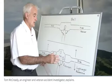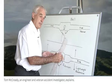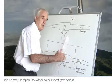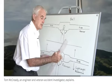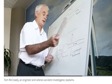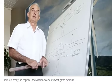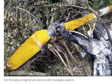Once it's out of track, an out-of-balance situation will develop very quickly in the hub. So you'll have the hub pivoting about that one single point, out of balance, and the blade out of track. Normally when it gets to that stage, it is unrecoverable — it's going to happen extremely quickly and extremely violently.